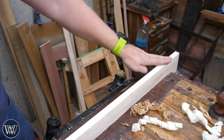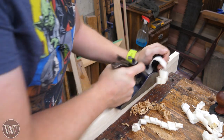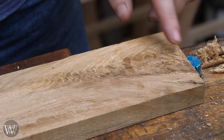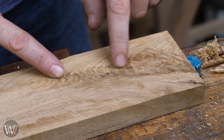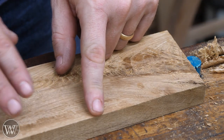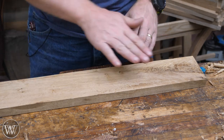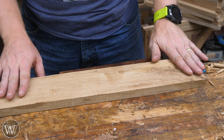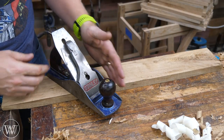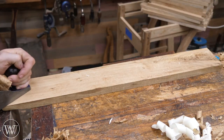Any schmo can plane poplar. This is poplar edge grain with the grain, and this plane isn't particularly sharp but I'm still getting really nice curls. You can grab a plane and go to town — if the wood's easy, it planes relatively easily too. But this is white oak, and white oak is not easy. This particular one has all this crotch figure, some curl, a lot of inclusions. The grain goes up and the grain goes down and it is all over the place. We're going to be planing most of this board against the grain — no matter which direction you go, you're going to be getting tear out. And we take this same plane over to white oak with this curl and twist, and oh yeah, that's a pain.